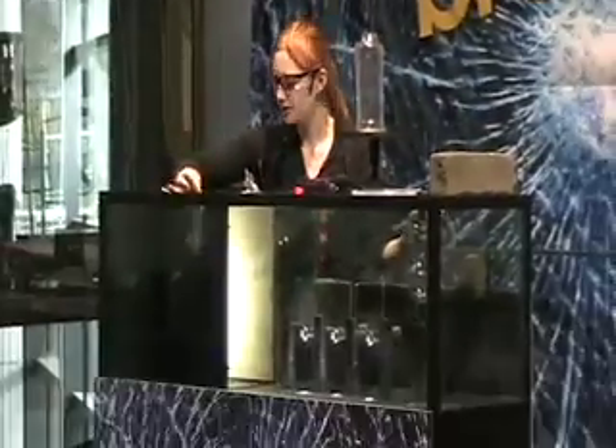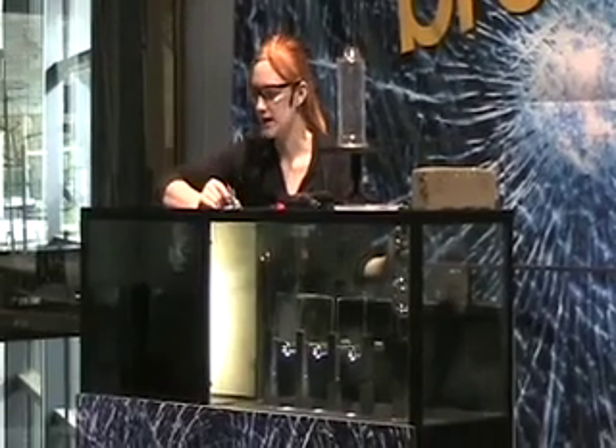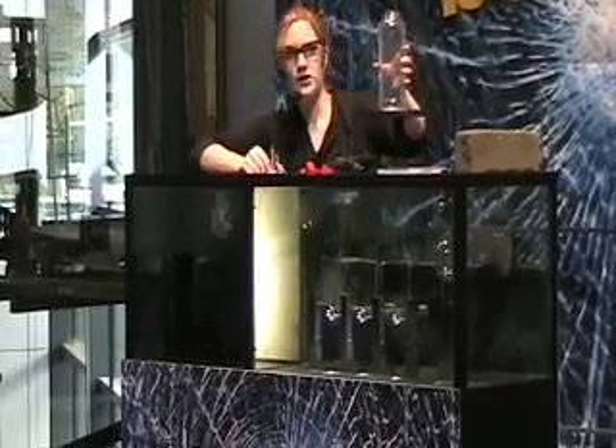This dark screen I have in front of me is called a polariscope. It's a device that helps us see stress inside of glass. I'm going to put this bottle underneath here. I'm going to focus my flame on just one spot for a few seconds — you can probably already start to see some patterns of light and darkness coming out inside of our glass. That right there would be stress. I'm going to leave that in there so you can use it as a reference point.